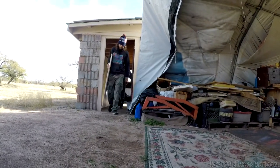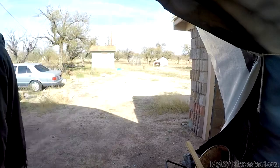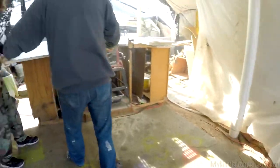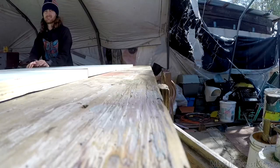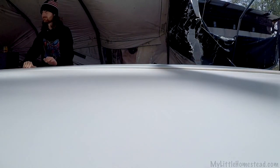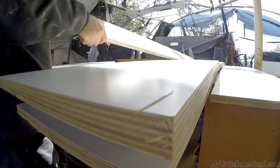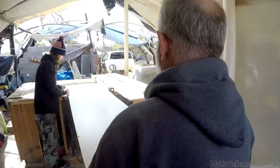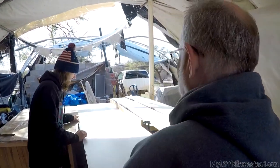We just got the mounting up for the shelves. Now it's time to move over and start actually cutting the shelf pieces. Bryson and I were making some decisions on the size — 12 inches and 24 inches on the far end. The trick is that with a 4x8 sheet of plywood for 12-inch shelves, you can't cut them exactly 12 inches or the last one will be 3/8 of an inch off because of the width of the saw blade.